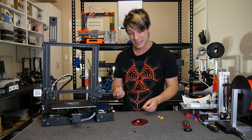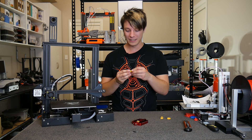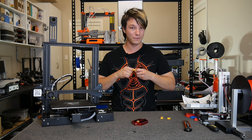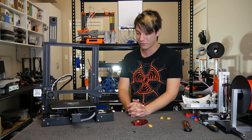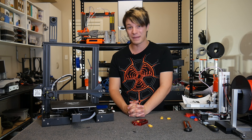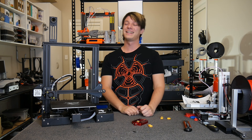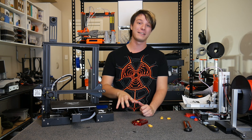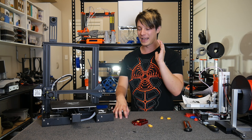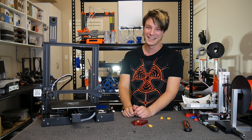Please, if you're concerned about this, just whip one of the heat shrink sides off and see if it's soldered properly. If it is not, get a 40 watt iron and pump some solder in — you'll probably be okay. But personally I would go with genuine XT60s. They are significantly higher quality. It's really weird and a bit scary seeing them against the knockoffs — the connection strength shows a much better contact and current transfer capability. I'm pretty much done talking about Ender-3. I hope! I really do — I want to get back to really cool things. Big thanks to TH3D for pointing this out and to some of you guys on the stream that mentioned it too. I look forward to seeing you again very shortly here on Maker's Muse. Catch you later guys, bye!